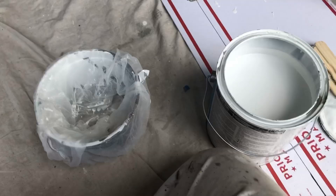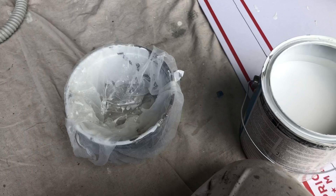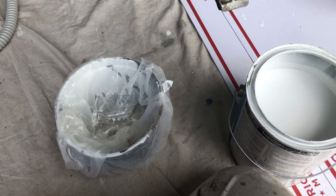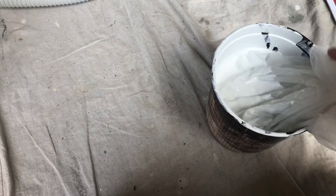The trick with this spray gun is interesting. I'm going to strain this paint, even though it's clean paint — I really want to make sure there are no little globs in there that will plug up the gun. Then we'll have to add water because it's got to be a certain viscosity, otherwise it'll spray funny. So just pour the paint through the strainer and let it go through.